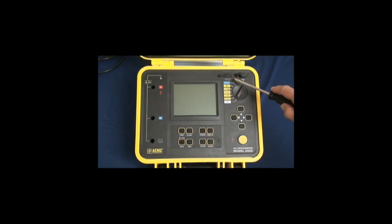There is also a 110/220 volt, 50-60 hertz charging port, and an optically coupled USB port for extracting data once stored in the instrument. The instrument can store up to 80,000 data points and can measure insulation resistance up to 30 tera-ohms.